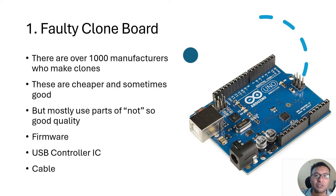For example, you may order 100 boards from China for a workshop or makerspace and find that some just don't work at all. The most common issue I've faced is missing bootloader. Ideally every Arduino board has an ATmega328 IC with an Arduino bootloader installed. Because of that bootloader you can download programs over the serial cable. Without it, you will not be able to download programs using a computer.